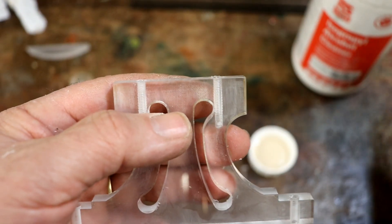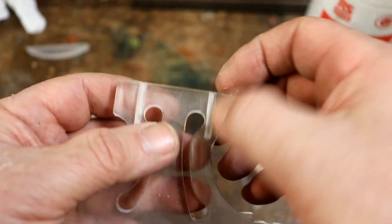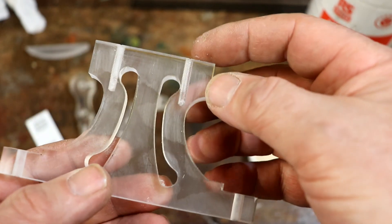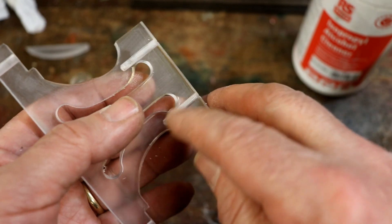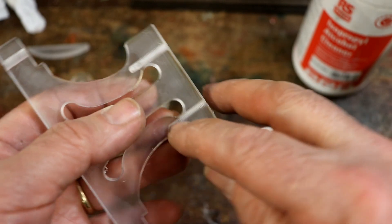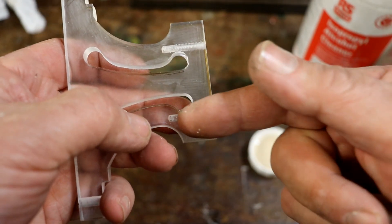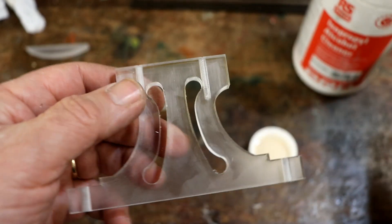The joy of the drill tap. I do take it out regularly just to clear the swarf, because it melts at a low temperature. But it's lovely. The great thing about drilling the holes first — 3.3mm for the holes for tapping M4 — is it means that when you put the tap in, you know it's going to be guided perfectly perpendicularly, which is nice too.